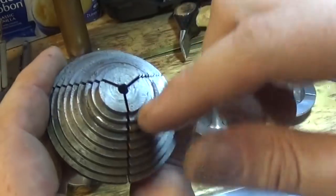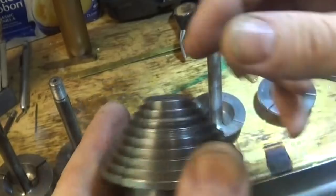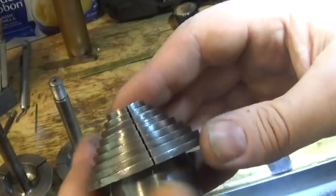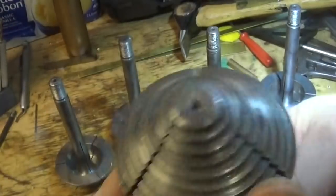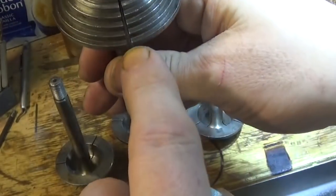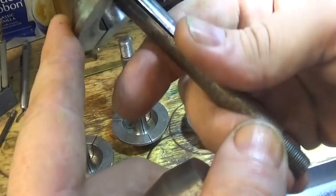This one's reasonably parallel and reasonably good. Probably a ring on the outside and a ring on the inside and clean all these up - that one wouldn't be too bad. This one's touching on the middle and it's got quite a gap here, so that's quite seriously bent.